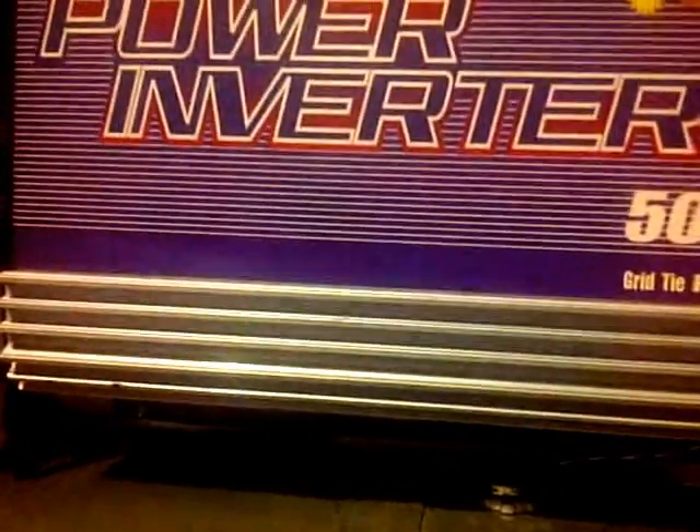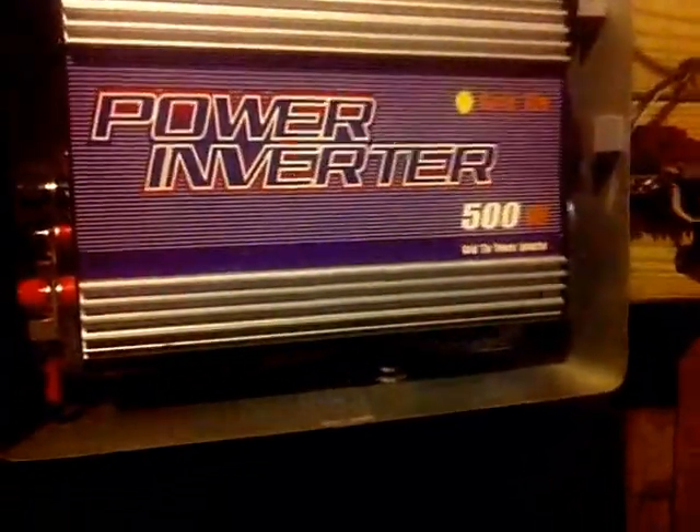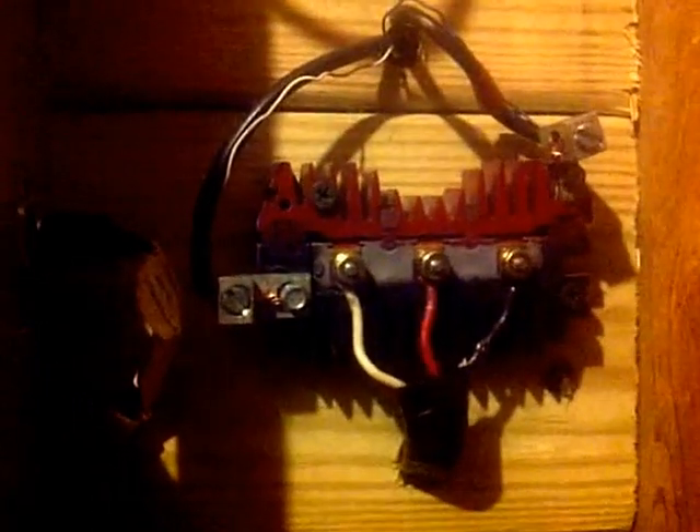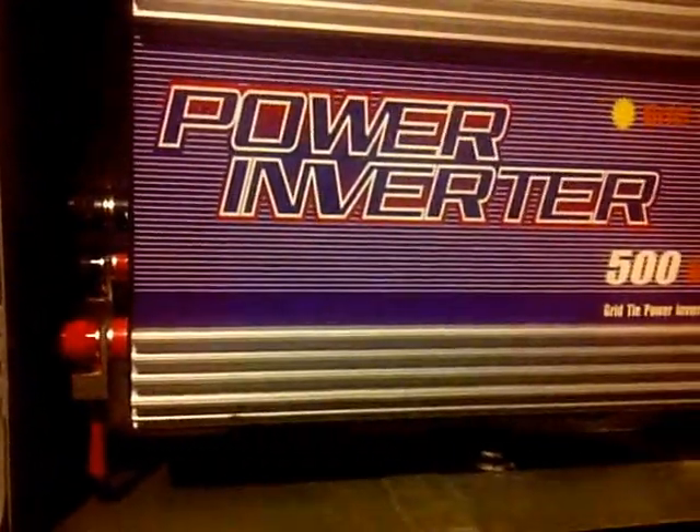One more thing I wanted to point out — I don't have a fuse on my DC side, and the reason is because there's already a DC fuse in this inverter, so there's no sense in fusing it twice. There's a 20 amp fuse in this inverter. I'm not making mega amounts of power where I'd have to worry about getting electrocuted, and when the turbine does spin, nobody's really back here anyway because it's too windy. If you want to put a fuse between the rectifier and the positive lead, please do — I recommend it, especially if you're just getting into this. But this inverter already has a fuse and does protect the DC side.